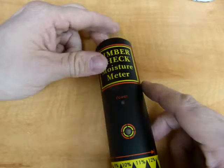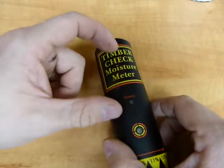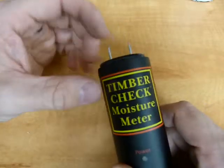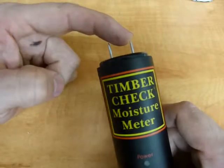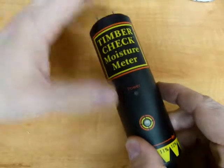At the core of this instrument, there's a 9-volt battery. The 9-volt battery has two terminals, positive and negative. One of them is connected to this probe and the other one is connected to the other probe. So that's one part of the circuit.